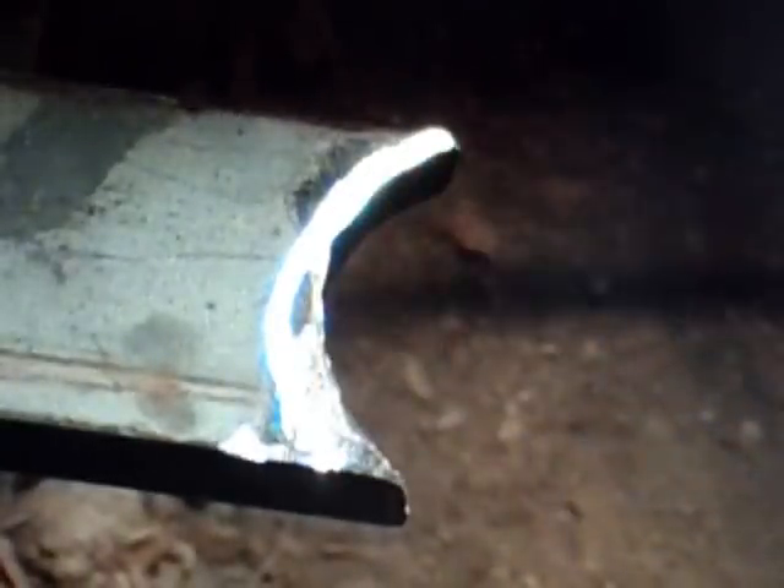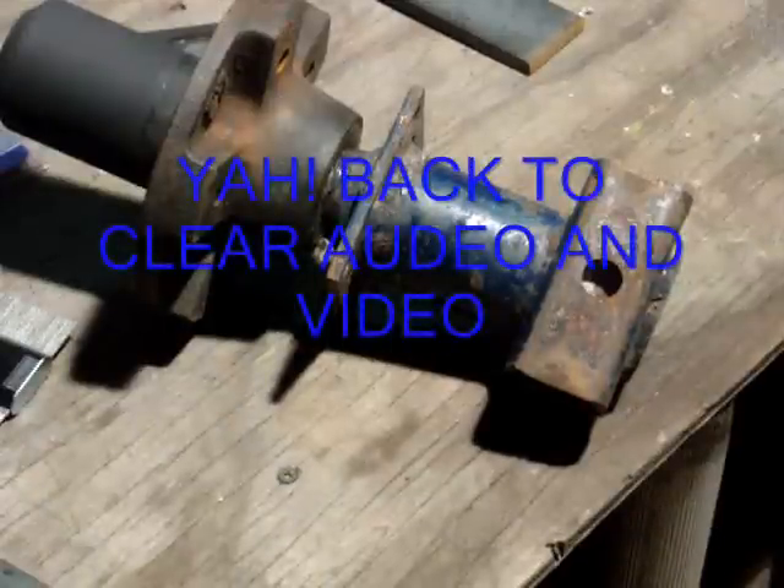That's pretty close. See how that matches up pretty close — I think I need to knock the sides a little bit. Almost perfect. Let's see if we're square on the tips, and we'll take this side off. That'll help it weld a lot easier — clean surface. Got to do it to the other ones too. We've got nice clean metal; that helps it weld real good. Got to do the same thing on the other piece. Now we've got to grind off a little of this and get this all set up so it'll weld nice and easy.